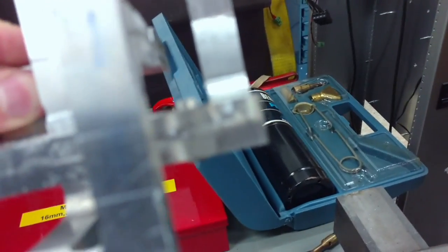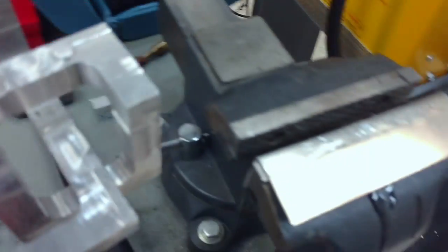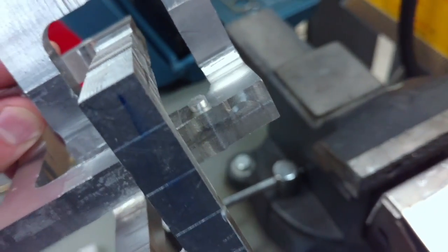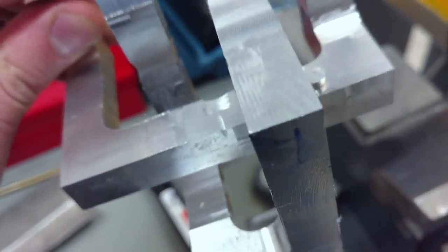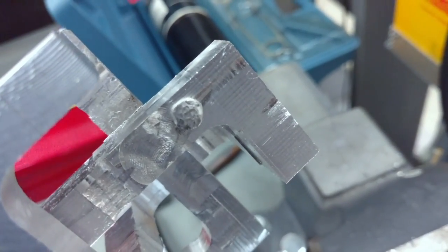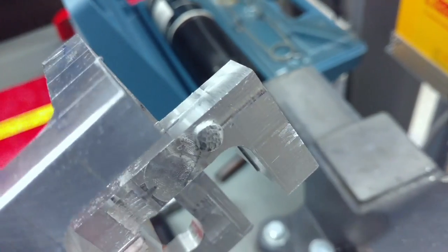Perfectly in that hole with no interference, a little bit of clearance, which was quite all right. But then I put it into the vise here, and I used a ball peen hammer, the ball part, and I just started hitting it down, and now it's pretty much stuck there. So I'm going to do that on the other side, get it nice and hard, smashed in hard, and then I'll take a file to it, which when it files down, I think it should be pretty snug in there. If not, I'll drill it out, put some glue in it, do something different.